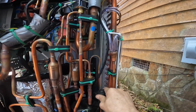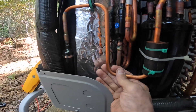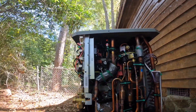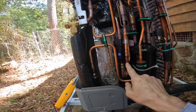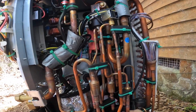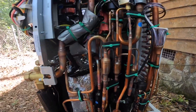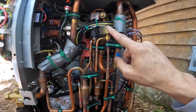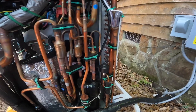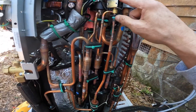All right, that's the condenser expansion valve. This might just be a solenoid. All right, that goes right into the compressor — this line goes right back into the compressor and it's coming off of right here, going up to this valve right here, the solenoid. When it's very cold, it allows that mid-temperature, what should still be high pressure gas, to come through here and go to the compressor — so it's done with this solenoid.